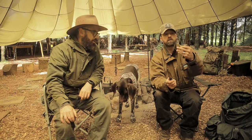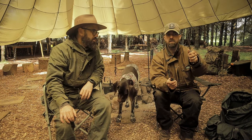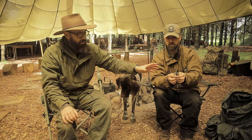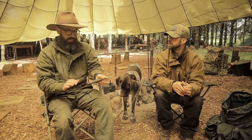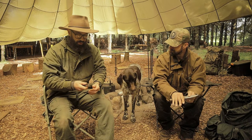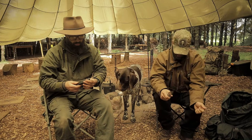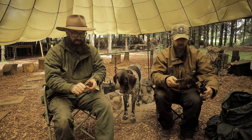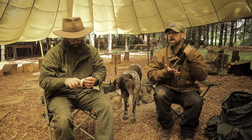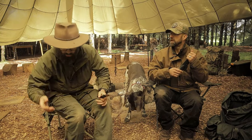That's a hard use. Even at 3 mil, you would consider that a hard use. Oh yeah, absolutely. My original thought was that if this was to go any further, the handle would be rounded, it would be sanded down here for thumbs, and this would be 3.5 to 4. I found that if you go too thick with the Scandi grind, you're going to go into the territory where it's unusable. Forget about field prep.